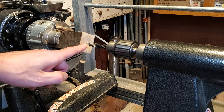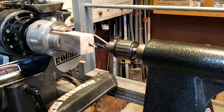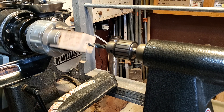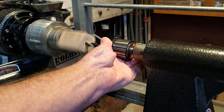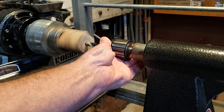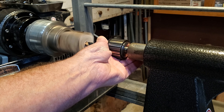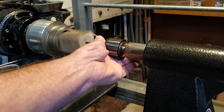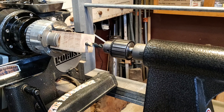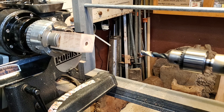I drill them and install them the same way, other than the depth. I'm going to turn the lathe speed down and just drill straight into it — I have it marked right there. Turn it up just a little bit. There we go. Turn off the lathe and pull that out of the way. I use the 7/16 drill bit.